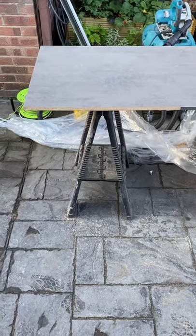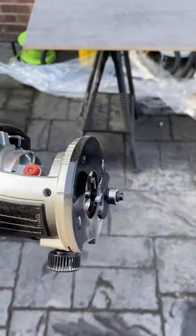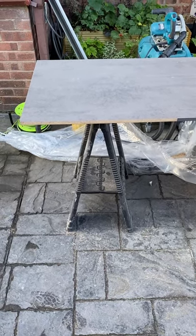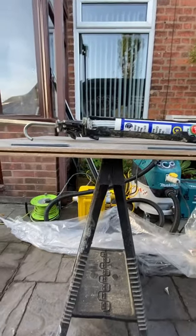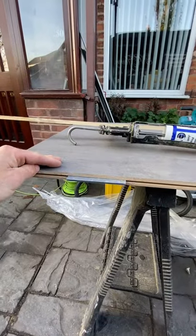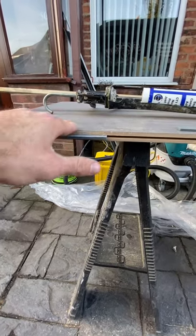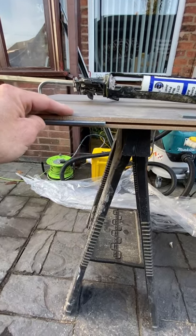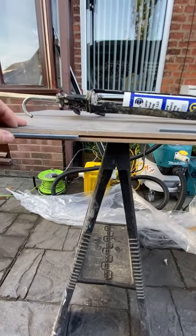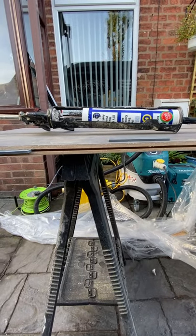So with our female cut now, I'm just going to show you what I mean by router and biscuit joint. Here I have my palm router with the biscuit cutter in the top. I'll just run that along the face, which will make a nice home for the biscuits to sit in, then they'll get glued up, pushed together and left to set. So once routed out, this is what you should be left with — a nice clean cut channel. These packers which the company sent to use as biscuits — sometimes you get timber biscuits, but obviously these are plastic. All they do is bond each worktop together and keep the top flush. We're going to be using CT1 to bond these together — you can use PVA or any other industrial type adhesive for whatever worktop you're using. For this MDF, CT1 is more than adequate.